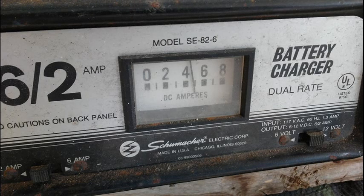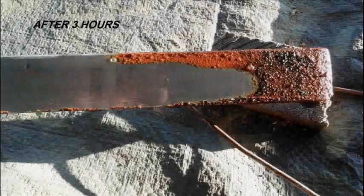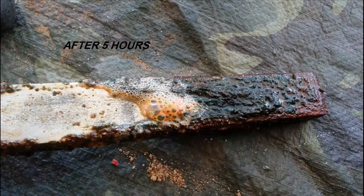The charger was reading just under 5 amps, and my voltmeter on the charger clamps was reading 8 volts. As the process progressed the current went down and the voltage went up — I guess Mr. Ohm was right. I let the process run for a total of 15 hours over 2 days, checking it every couple of hours by removing the electrode and looking at how much rust had accumulated on it. It looks as if the process progresses faster the longer you let it run.